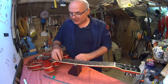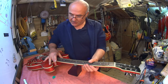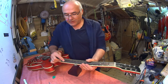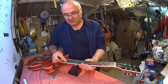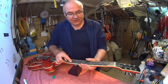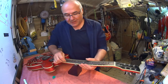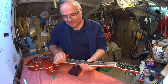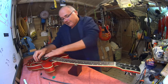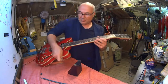common for there to be a bit of a glut of frets at this end, because the neck tends to bend less, especially on a glued neck, right at that point, and it can make a little shelf, which there's really no option but to just scoop it out a bit with a fret leveling tool like this one. With a flat leveling tool, you can't do that scooping out, so what luthiers tend to do is the thing called fall away, where instead of what I'm doing, which is gently imposing the curve on this slightly flattened off spot, they would tend to just level everything backwards from about the 13th fret, just to be absolutely sure that everything will play.